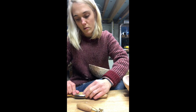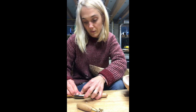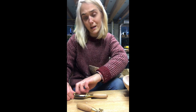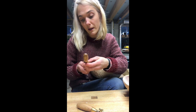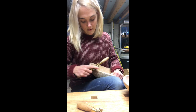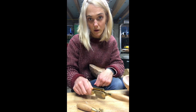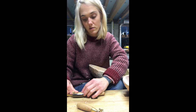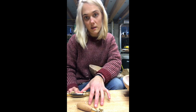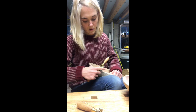I went a little too deep on that cut, so I just rest it against the bench, which I know is flat, then I reference the face plate and tighten up again. This way I'm going from a light cut — or maybe even no cut if I've made it a little too tight. If I need to make an adjustment, I can either take a little mallet and tap the top, or flip it over and give it a light tap on the bench. If it's still too heavy a cut, I rock it forward and tighten it up.